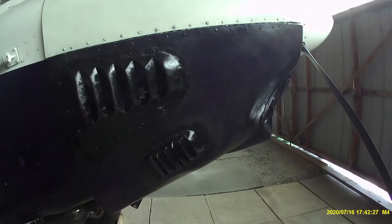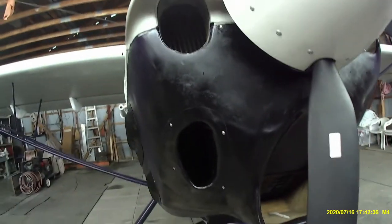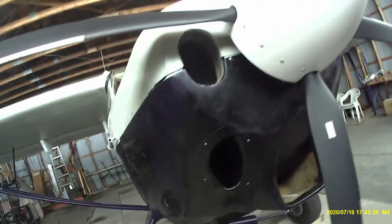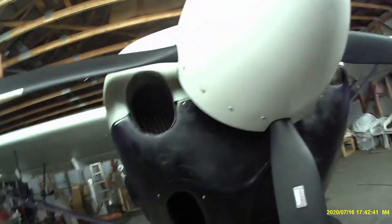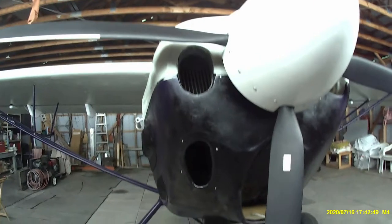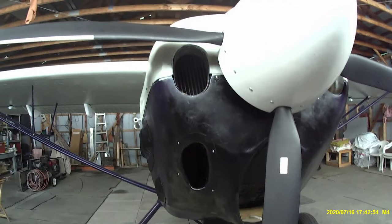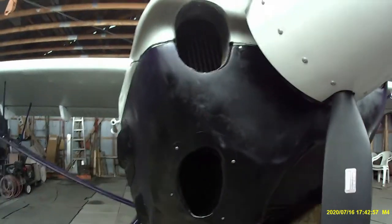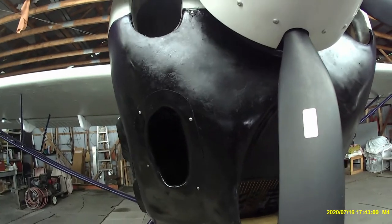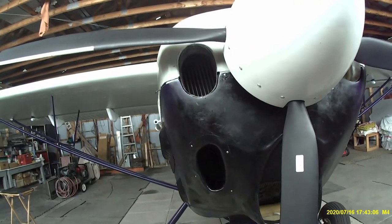In conjunction with changing to a better, more aggressive type louver, and changing the intake — I had a small two and a half inch round intake going in there — I've swapped that out for this rectangular smooth profile intake, which I like physically and visually a lot better. It's definitely better, and of course it allows the most air I can get into that heat exchanger, which is what it actually is — it's an oil cooler I'm using as a heat exchanger or heater core. It gives me hot air for cabin heat and acts as a secondary radiator.